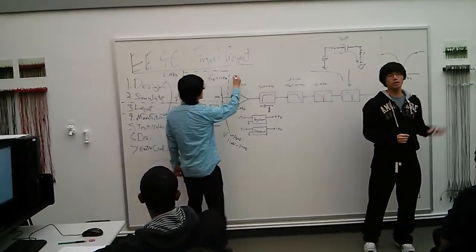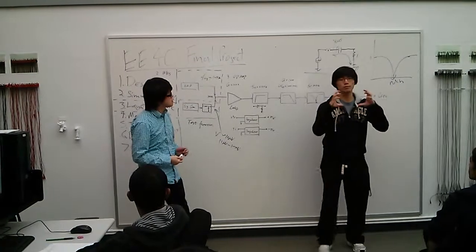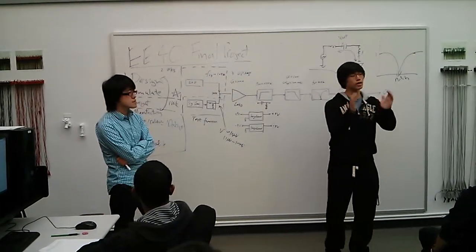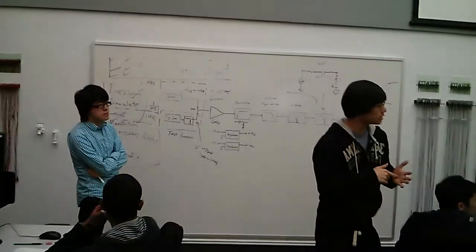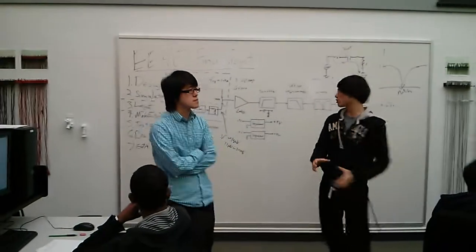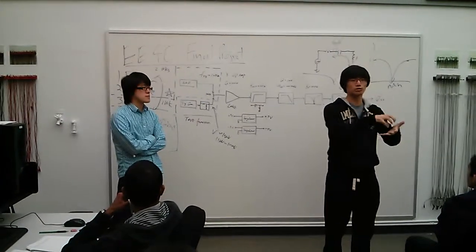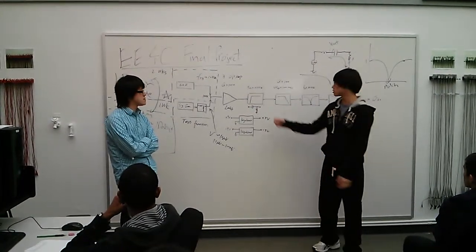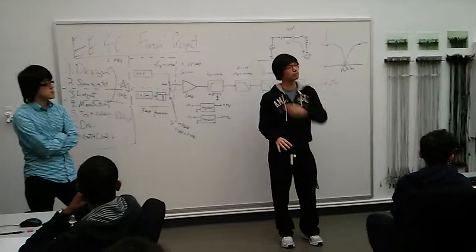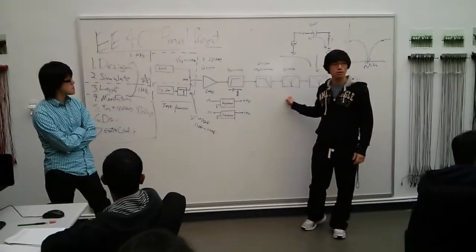A way that you can mediate this is by creating these things called modules. They're basically like blocks, and it'll look like this on your actual circuit. So what you're doing is creating a little block. In Multisim, go to place, and then do new hierarchical block. It'll create a box that looks just like this. You can edit that box, and inside of that box is your actual circuit. But when you put it out on the schematic, it'll just look like this, so it doesn't take up as much room, and you can keep track of the different stages. So instead of putting the entire circuit on one Multisim sheet, you can split this up into hierarchical blocks to do it part by part.